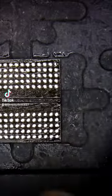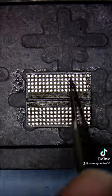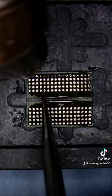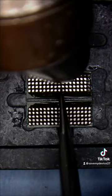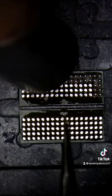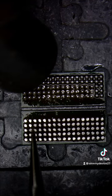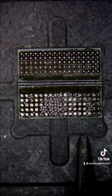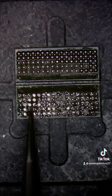What is up guys. This is a RAM chip off a PlayStation 4 — I had to pull this from a donor device and unfortunately it was not reballed. Reball is when I replace all these little tiny balls. These are 0.5 millimeter size solder balls, and unfortunately I don't have a stencil for this exact RAM chip, so I am doing them all one at a time.